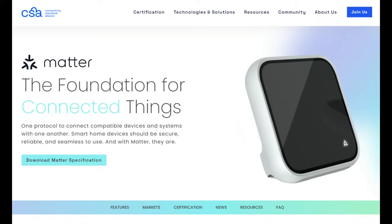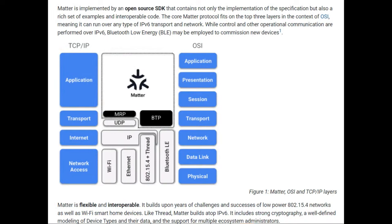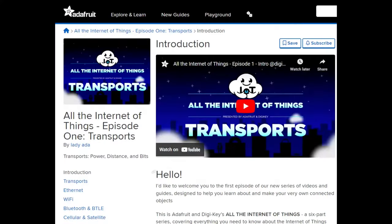So if you are working in the IoT space making smart light bulbs, temperature sensors, or whatever, and historically you would have had to have a Zigbee or Bluetooth gateway, you might want to use Matter. What's nice about Matter is it can use any transport: 802.15.4 plus Thread, Ethernet, Wi-Fi, or Bluetooth. A lot of people are interested in using Zigbee because it's a low-power, low-overhead transport.